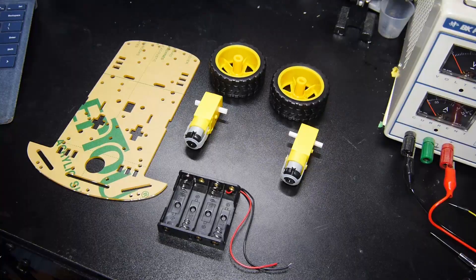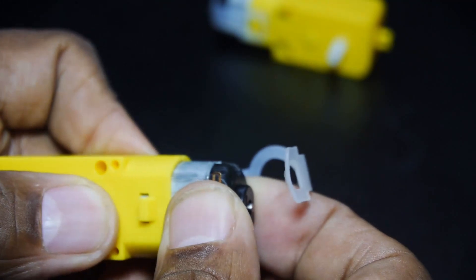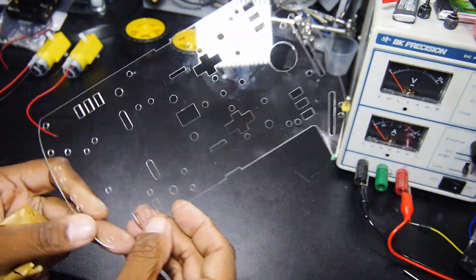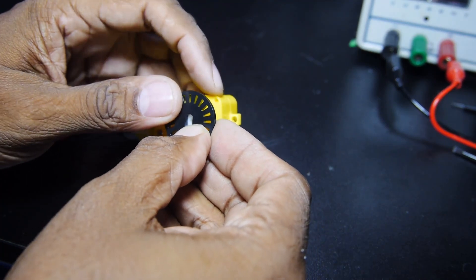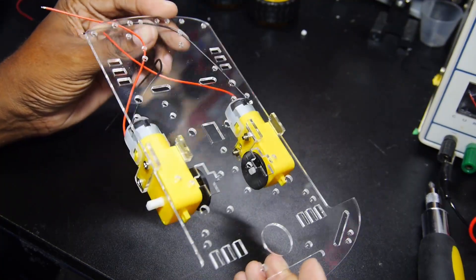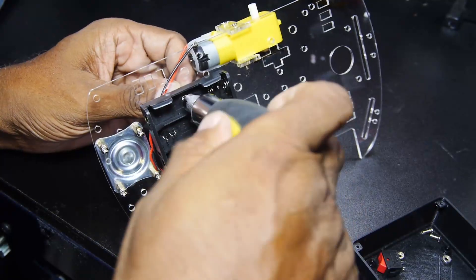The last few lessons involve a car chassis, which has a frame, wheels, gearbox, and battery holder. The gearbox units are quite nice with two output shafts and a removable motor. There looks to be some sort of encoder wheel for the gearboxes, but they were not used in any lessons. I soldered wires onto the motor first, peeled away the protective coverings on the plastic chassis, then mounted the gearboxes, motor controller, swivel wheel, and battery box.